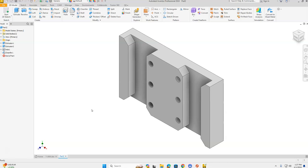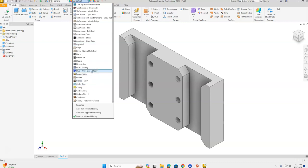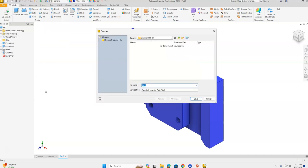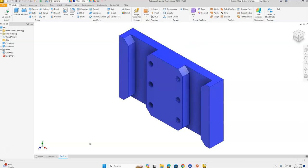The One Jam is finished. Go to the material section above the ribbon bar, click the pull-down arrow in the Default section, and select Blue Wall Paint Glossy. Then go to File in the top left, select Save As, make sure you're in your H drive folder (first initial, last name, triple zero), change the file name to "1 jam" and click Save. In the next video we'll take you through how to cut this part and run the tool path for the CNC mill.